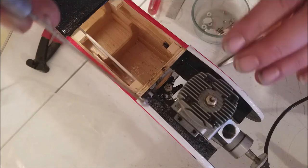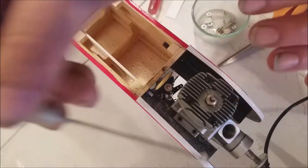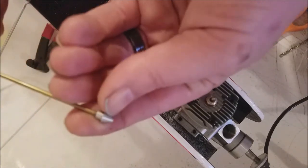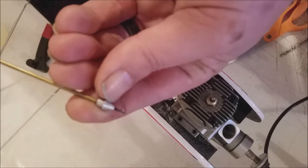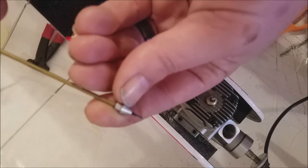for the motor. Now this is really important. You want to get this right. I'm going to use a hole locator. This tapered section locates the center of the hole, and you use that drill bit to twist in to mark the hole. You're not going to use it to actually drill the hole, but just to mark it.